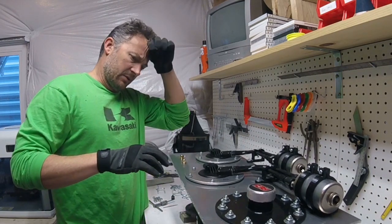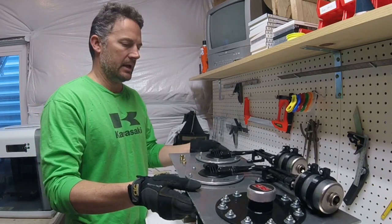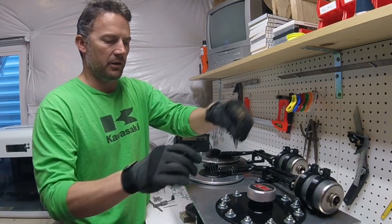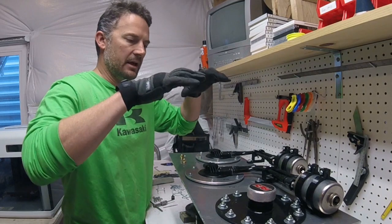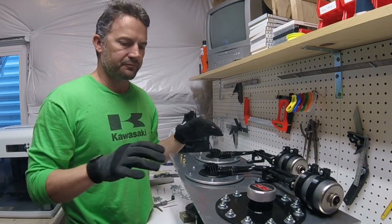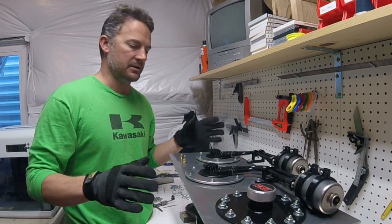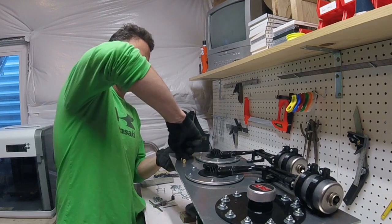So I'll be working on welding that. Then once I have all that welded up, I need to reinstall all this, putting all the threads in and doing threadlocker to seal everything up. Then install all the components. Then I need to pressurize it so that I can see if I have any leaks, and typically I do have leaks that need some attention.